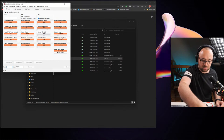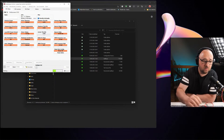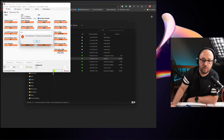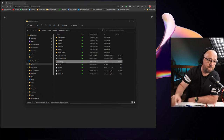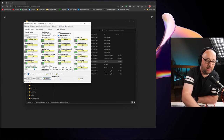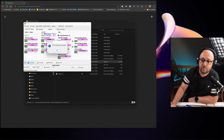So let's plug in the flight controller. Connect multiple ESCs. Okay. No, so this is not BLHeli_32, so we will have to test with regular BLHeli. So disconnected. BLHeli Suite. But this seems like one of the phases on the motor is dead. Okay, now... Yeah, so that was that.